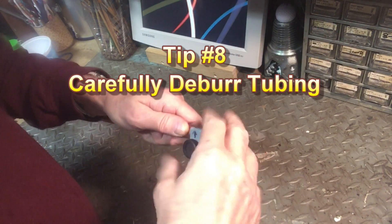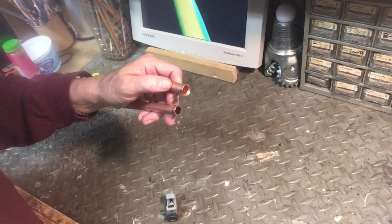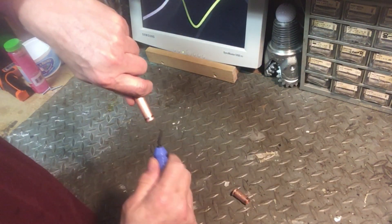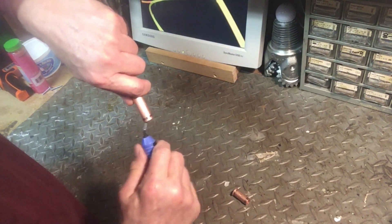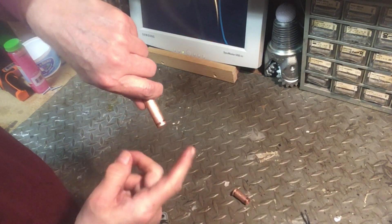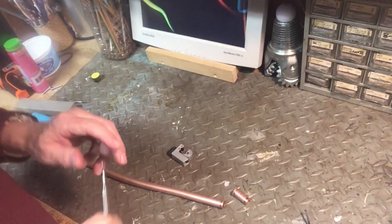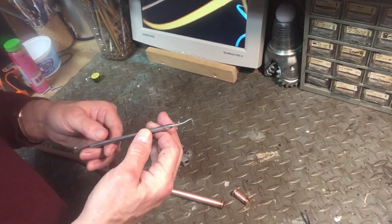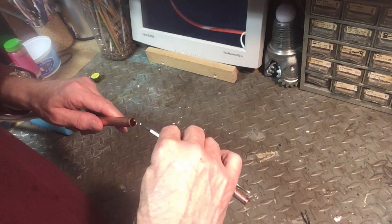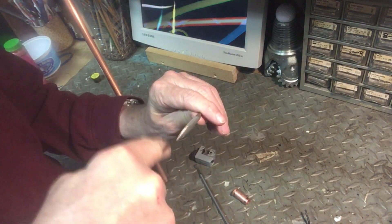Deburring and flaring are the most critical parts of the installation. You want to carefully deburr the line after you have cut it to length. No matter how careful and light with your touch you are, you will likely leave a burr on the inside of the tubing after cutting it. There are deburring tools available like this one, but sometimes they leave their own little burrs, and for one job you don't really need one. When deburring, make sure you leave the end of the tubing pointed down at all times so no copper scraps get into the line. Shake any scraps out. Use something sharp to test for burrs — I use a dental tool. Slide the sharp end out of the tubing feeling for burrs; they will be easy to feel. I use a fine half round file to file the inside just enough to remove any burrs. Always keep the tubing pointing down.